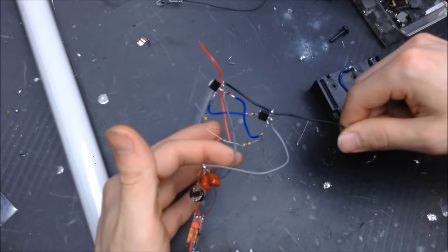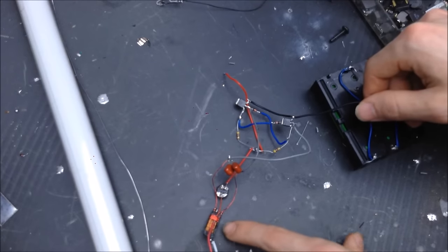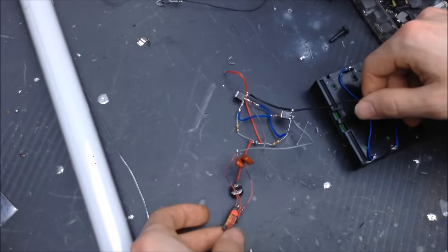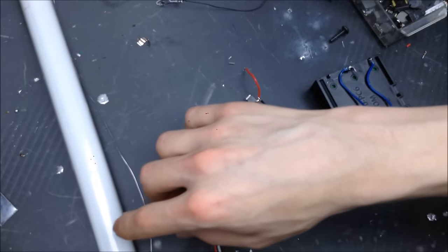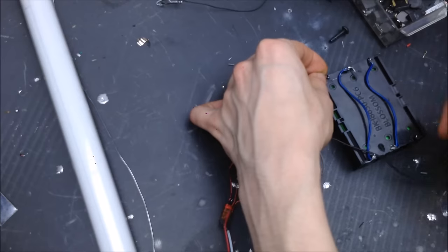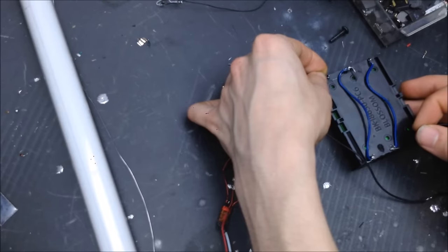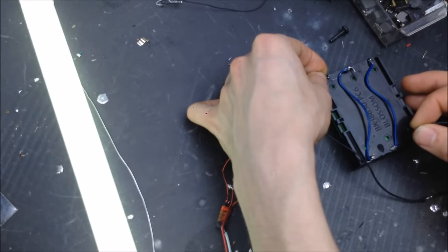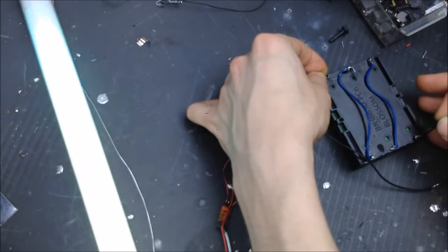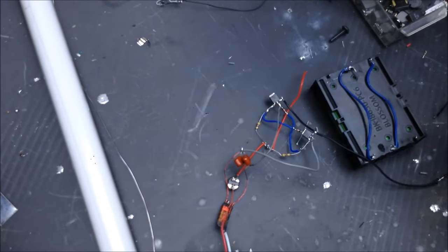So I have made repairs to this ZVS, and I have it running now on 12 volts. We have a little inductor, two capacitors, this little transformer, which is now not as good as it was. One of the sides broke off. And we've got it shoddily connected to this fluorescent light bulb here. So, if I hook it up, it's at 4.2 volts. Not much really anything. Moving over to 8.4 volts, you can see it lights up. So that's pretty good. And then moving on to 12 volts, even brighter. Well, actually it seems to run about the same. So let's run it on the 8.4 volts.